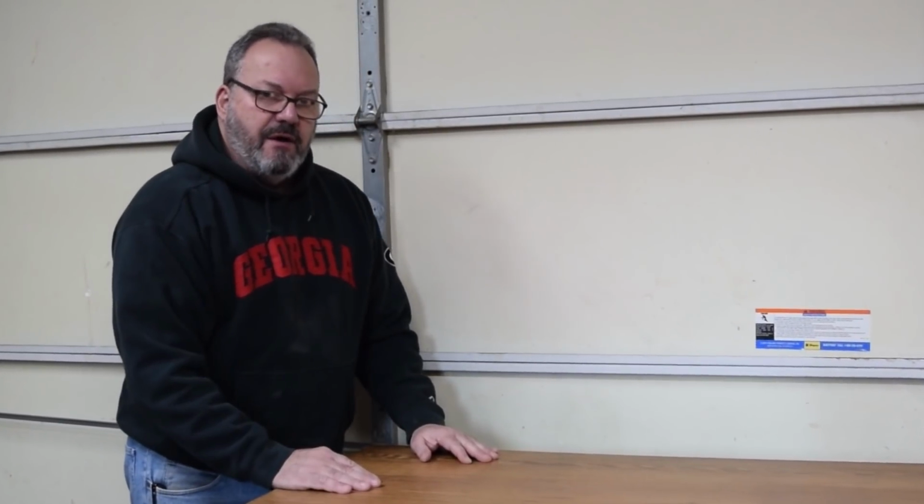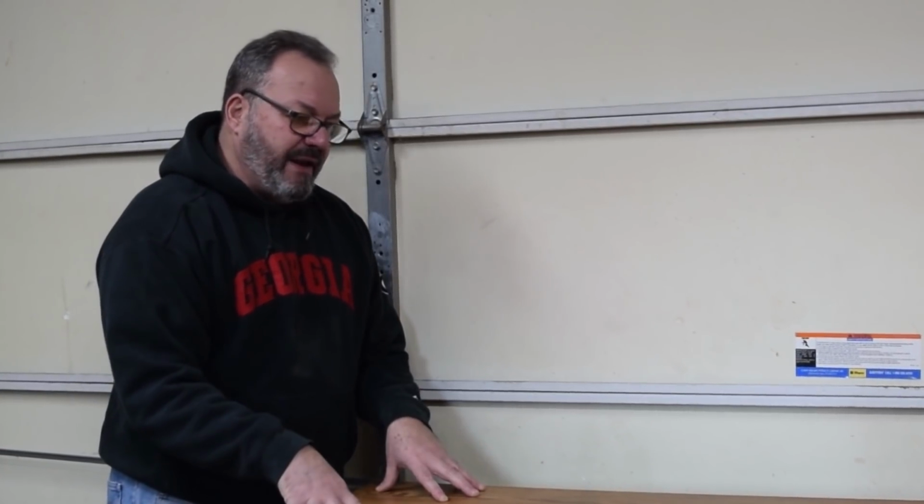Good morning, it's the next day. Last night I came in, sanded the top, shot another coat of sealer on it, and early this morning I sanded that back with 320 gold. I don't believe the top is going to require a grain filler. Again, we're trying to match the texture to the existing, so I think it's time to move forward and start to color match this, so here we go.